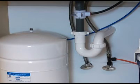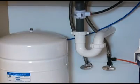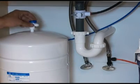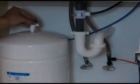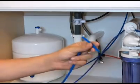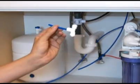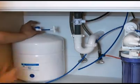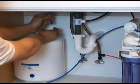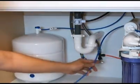The next step is to locate your pressurized tank, which will hold and dispense all of your new drinking water. We're going to go ahead and use some plumber's tape on the threads on the top. Once you've applied the tape, you can go ahead and attach your RO tank valve. Having a valve here will allow you to remove the line without water spraying everywhere. Using a hose clip or a sharp knife, go ahead and clip off a few inches of hose. Take that small piece of tubing and insert it into your push connect T, then insert the other end into your RO tank valve. Now locate the blue line coming out of the faucet that we installed and push that into the top of the tee. Then locate the blue product water line coming out of your RO system and put that into the other end of the tee.